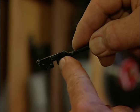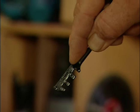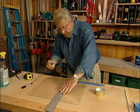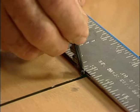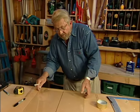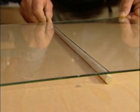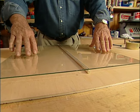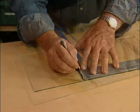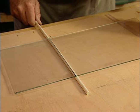The way I hold this — with the teeth or notches facing downward — I place my first finger about right here and tip it up at about this angle. I like to dip the cutter in some oil; it acts as a lubricant. I get a good grip on my straight edge and make just one scoring cut. You want to break the glass fairly soon after you score it. The way I like to do it, just to make sure I get a straight cut, is to put a piece of dowel under the score and then press down on two sides. I repeat the process to cut the glass to length — first scoring, then placing a dowel underneath, and finally breaking.